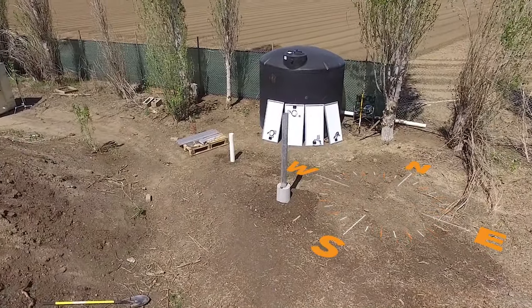While the pump and everything else is going to be hanging from our drop pipe, we do recommend installing a safety rope. This is a quarter-inch polypropylene poly rope — we're going to tie this to the top of our pump and tie it off at the top. If our drop pipe ever breaks, it's going to give us something else to pull on in order to get the system out.